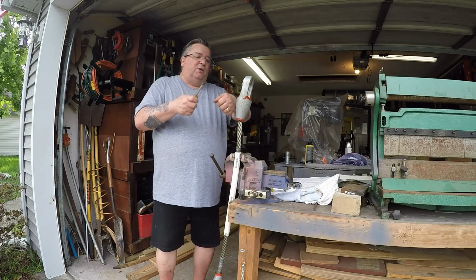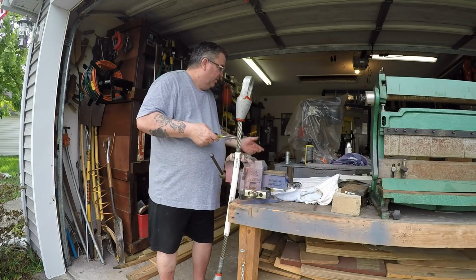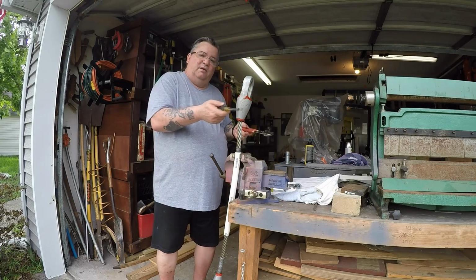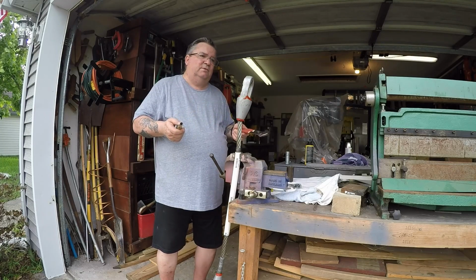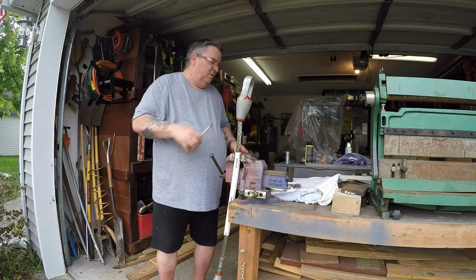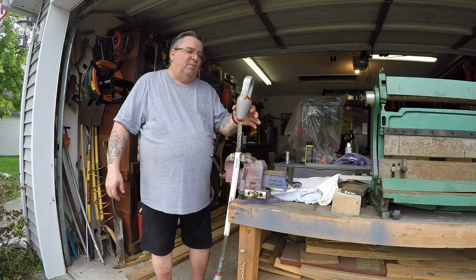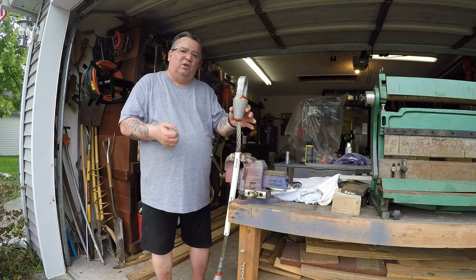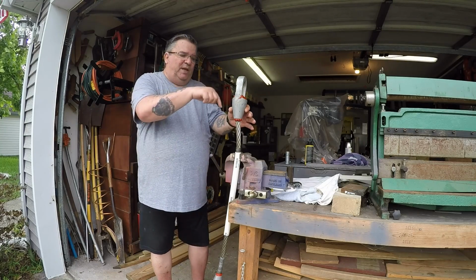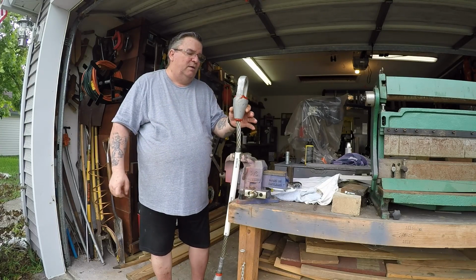But when the one person comes over and starts pouring it in there, you have another person with, I don't know, a wrench, could be a large screwdriver, whatever. It vibrates this so that when you're pouring it down, if there's any trapped air bubbles in there, they'll be released from the vibration. They'll be knocked loose so they can go up and allow all of the zinc that's being poured in there to establish and bond with the wire filaments.